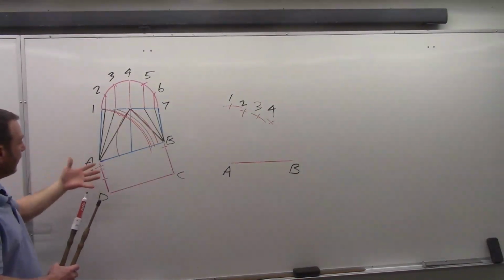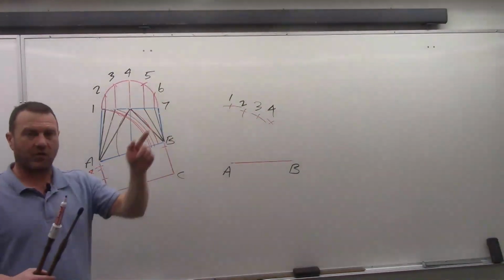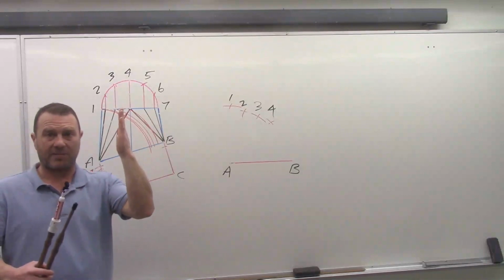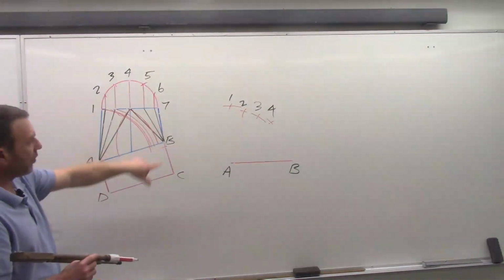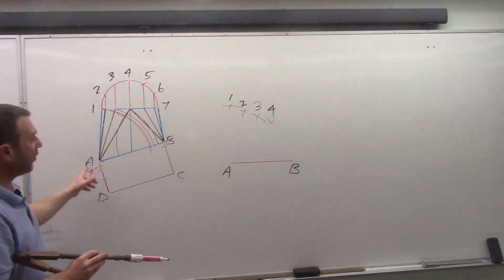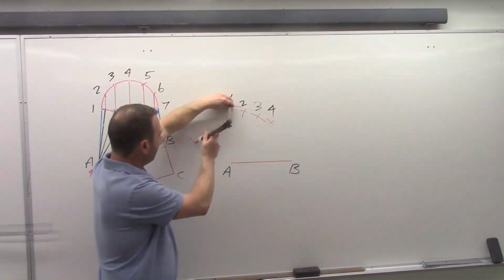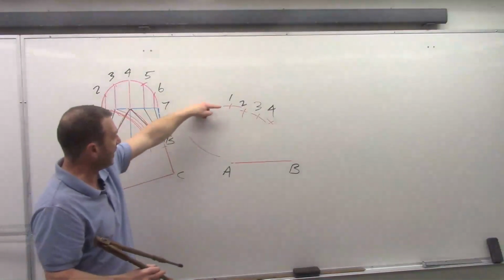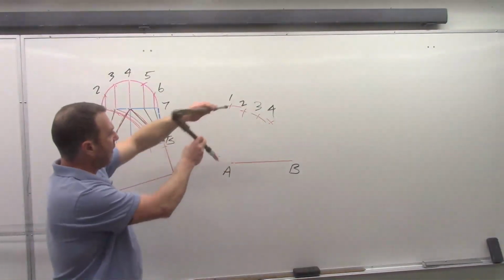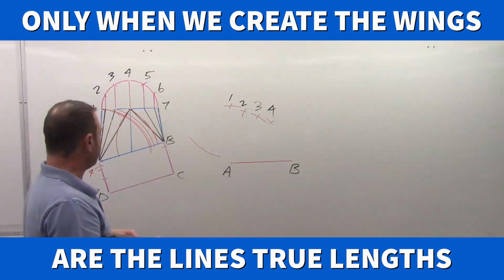And even though D is out here, when that wraps in, that's the center point. Okay, at A1, it's going from center of the round all the way to the outside corner or the back corner. D1 is going from center at the top to center at the bottom. And that tells us it's just straight up and down. It's not leaning anywhere. So for my next line, when I start working these wings, I pick up A1, and that actually represents the true length of line D1. And where I'm trying to get to now is point D down here. So I flip my dividers around and I swing from 1 coming downwards. Now, a good way to remember it is the line that you swing downwards is the true length in the elevation view. Remember we said everything up top here we had to develop a true length for. But when we swing downwards now, we're picking up the true length right from the side, right from the elevation view. So I got that one, that's D1.